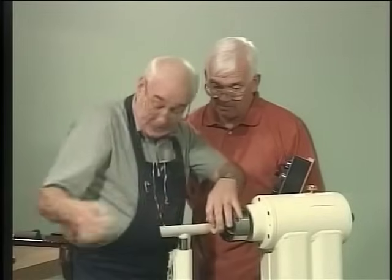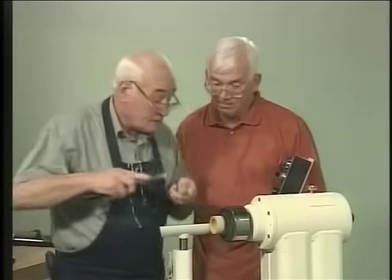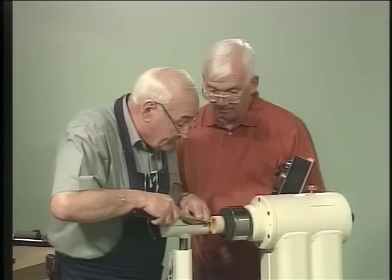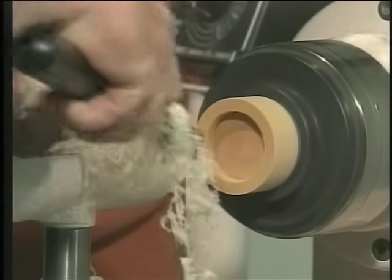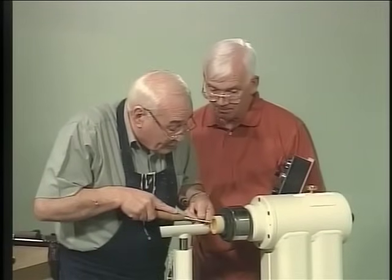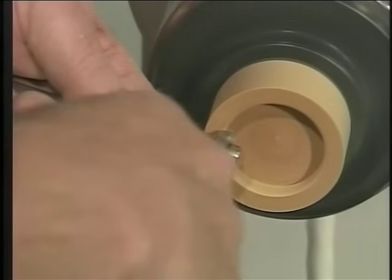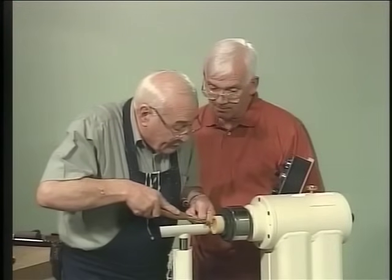These threads, hear that squeak? Mm. When you polish your threads, that actually goes. Right. So I'm just going to take a little bit more off this. Again, don't be too ambitious in taking it off. And again, just round over that sharp corner. But you see, by working it this way, we're actually taking it into a thread rather than working away from a thread.